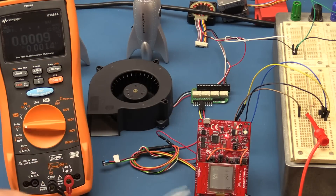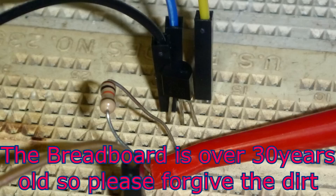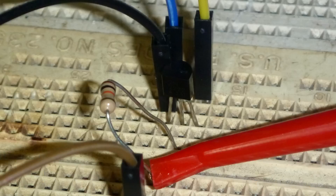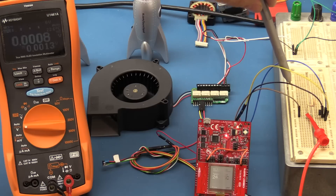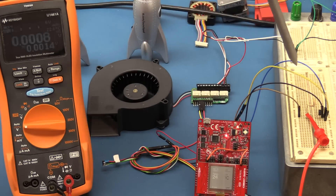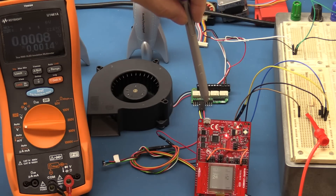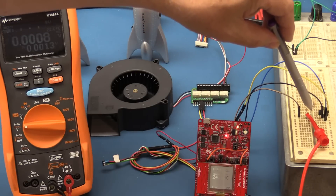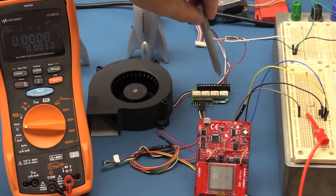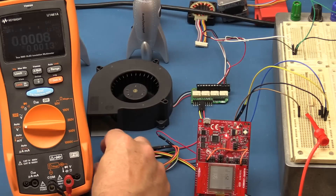The output from the launchpad comes up here. I have a control signal from the launchpad — the brown wire — going through a 10k resistor to the base of the transistor. The emitter goes to ground via the blue wire, and the black wire also connects to ground. The red wire from the relay board goes to 5 volts of the launchpad. So if the GPIO pin goes high it'll turn the transistor on, and the normally open contacts of the relay will close, turning on the fan.